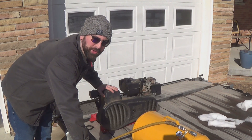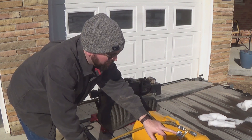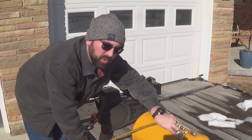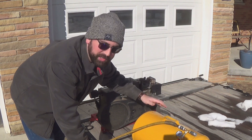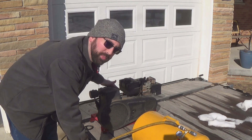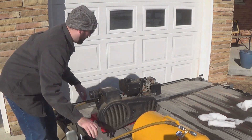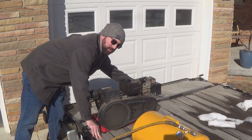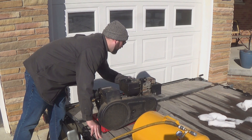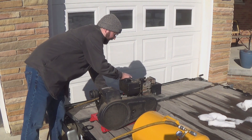This is kind of the moment of truth — let's see if this home-built gas air compressor can actually fill this tank with air. Shooting for 125 PSI. I also want to see when it gets there whether this little pressure relief valve is enough to blow off the excess pressure, or if it keeps climbing and I need to throttle the engine down or shut it off. So I've got the air hose hooked up from the output of the compressor to the inlet of the tank. I'll flip on the ignition switch — a little toggle switch to turn it on and flip it off when I need to shut the engine off — turn the choke on, give it a little bit of throttle, a couple pushes of the primer, and let's see if it'll start.